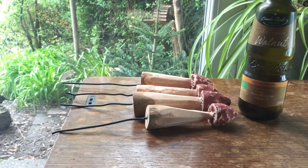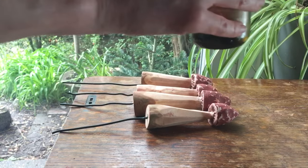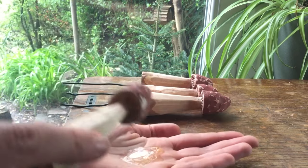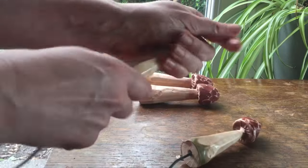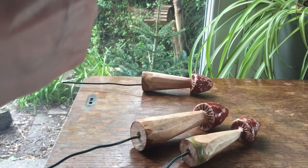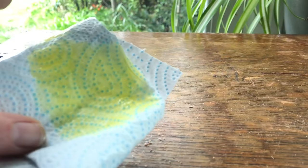If these are staying inside they don't really need much of an oil. For the ones I'm keeping inside I'm using some walnut oil, just rubbing it on the outside of the mushroom — it gives it a really lovely shiny finish and it smells really good too. For the ones I'm putting outside I'm going to use linseed oil and I'll use some kitchen paper to apply that. Linseed oil is a really nice oil to use for outdoor things and it's great for going over this old-fashioned milk paint.